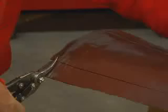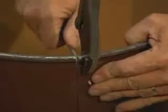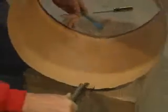Hammer smooth and remove the 5 centimeter rectangle at the bottom. Cut along the other line to create the opposite edge of the skirt. Join the two edges together so that the hacksaw cuts in the rim are adjacent to each other and clamp into place. Punch a hole just below the rim and secure with a screw or pop rivet. Align the bottom edge with the marked lines and punch a hole at least 5 centimeters up from the bottom of the skirt. Secure with a fastener.